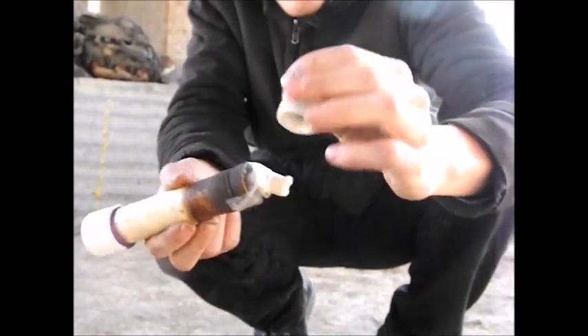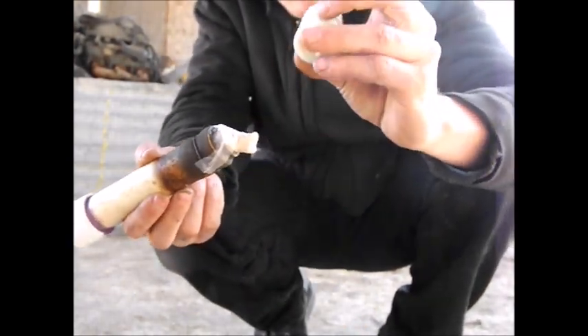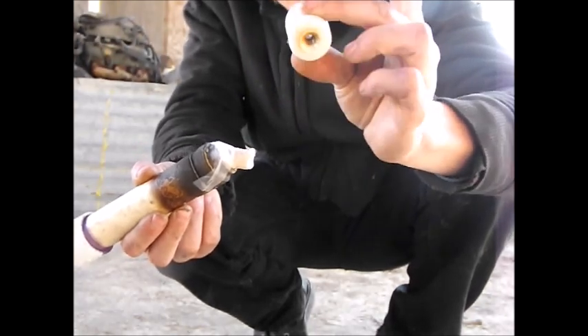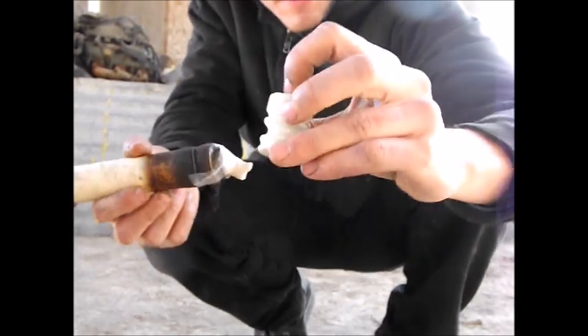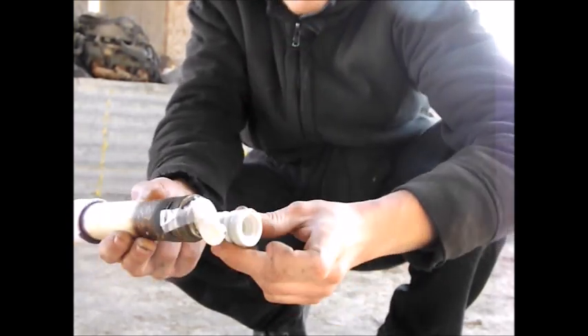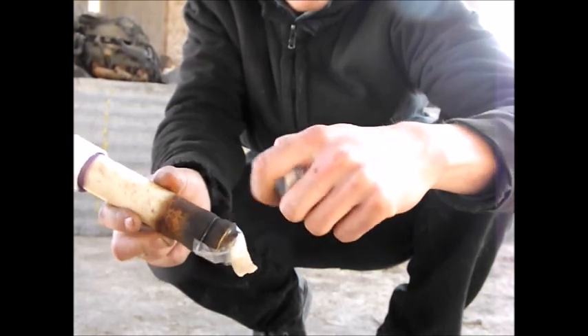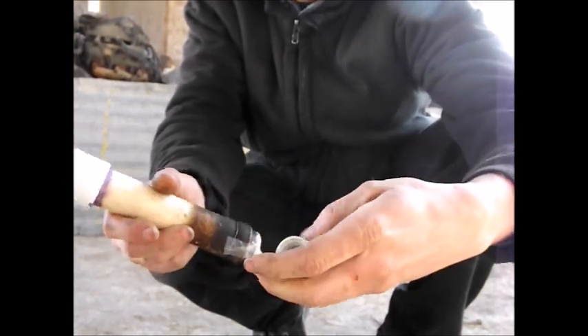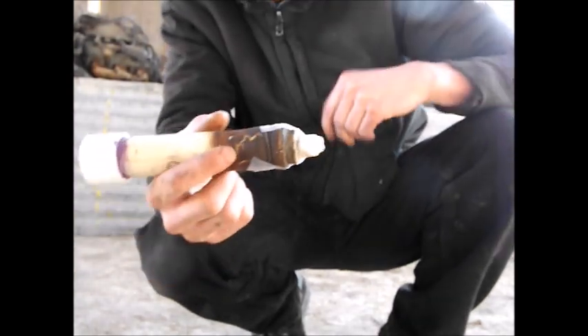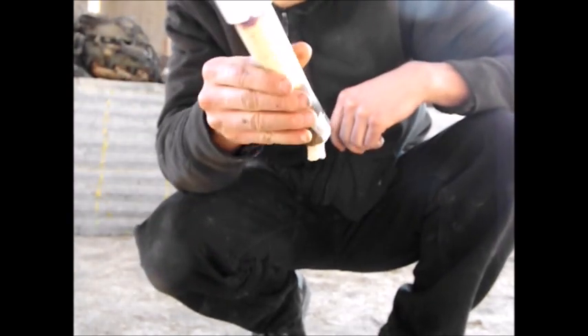Another difference is for the nozzle I'm using a piece of ceramic insulator. I found this thing — it's a perfect shape. It even has a nozzle in there for me and the hole is about the right size. So I went and stuck one of these at the end of the pipe. I had to melt it a little bit to get it to fit. You can see I even crimped it in there pretty good. Along with the epoxy, I don't think that'll ever come out. Then the pipe cap on the end.